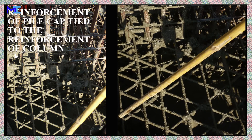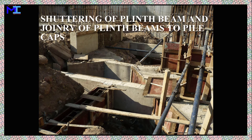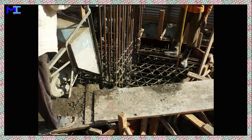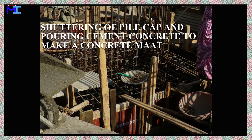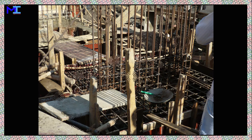The mat is made of concrete, which is an aggregate of small rocks and cement. This mixture has to be supported by formwork to avoid sagging and fracture while setting — a process known as shuttering or reinforcing. The materials used are long twisted steel bars between the piles, held in shape by thinner tie wires. Once this steel mat is laid, timber is attached around the perimeter to contain the wet concrete mixture. The concrete is then stirred to remove any air pockets that might weaken the structure when set.